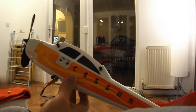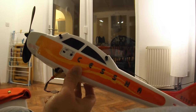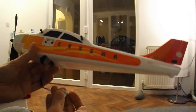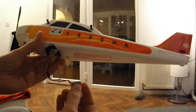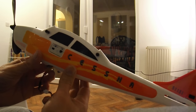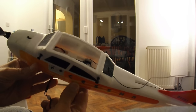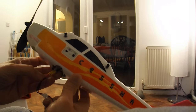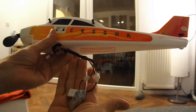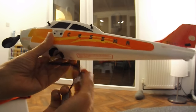It's not quite as much as we get from the NiCad battery, which is 4.8 volts. So it's obviously recognising the LiPo isn't giving it enough. I suppose I could try a 2S battery, but that might burn it out, because that'd be 7.4 volts, which fully charged is 8.4, I think, and this thing's only expecting 4.8, so that might be a bad idea. Trying another option: two of these LiPo batteries in parallel, so they're still only 3.7 volts, but more current.